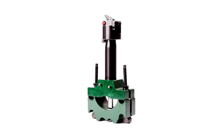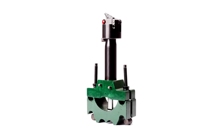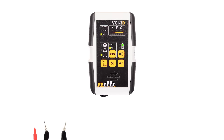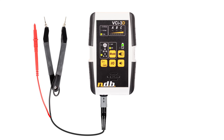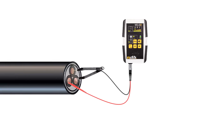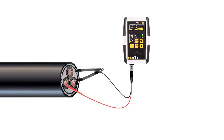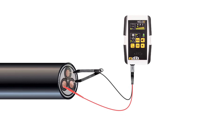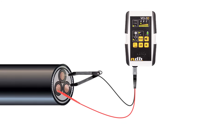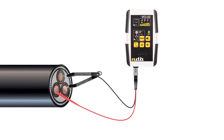Please note the VCI3 system does not replace spiking the cable prior to splicing. Once the cable is cut, the VCI compass-type sensor is used to perform phase identification. For this application, Mode 1 must be selected. Apply the two black leads of the compass probe on two conductors, then place the third red lead on the remaining conductor. The detector will display the phase identification for the cable on which the red terminal is applied. Try all three positions for complete circuit phase identification.